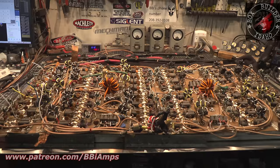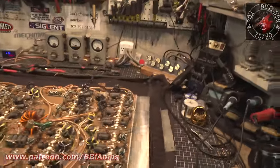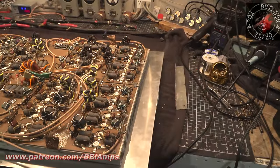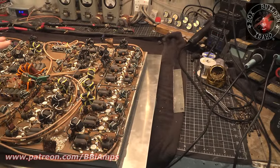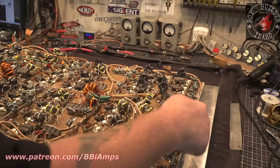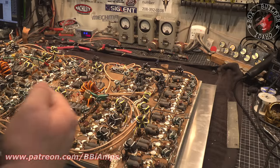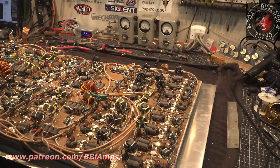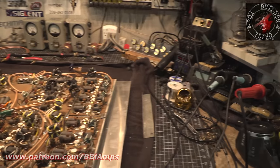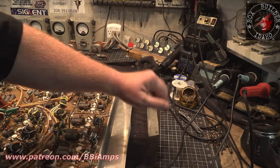Remember, I cut this aluminum specifically for this project so that it was long, way long. If you can remember, we had the width of a pen down here. For all the air that was traveling down the entire amplifier, we had the width of a pen here in the front for the air to turn and then head back 180 degrees in the opposite direction. We're going to do the same thing down here, at the back end of the cabinet. So we're going to provide as much room as we can up here to allow the air to collimate and flip directions.